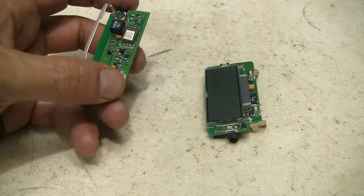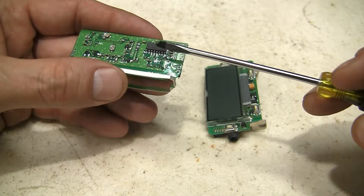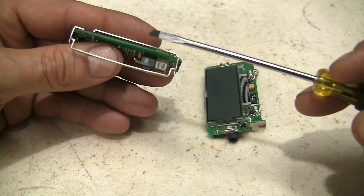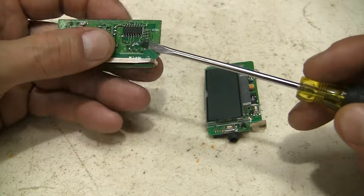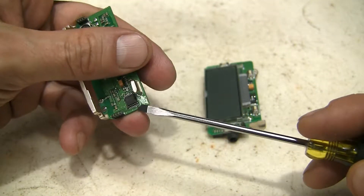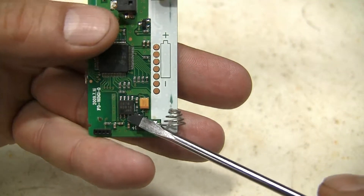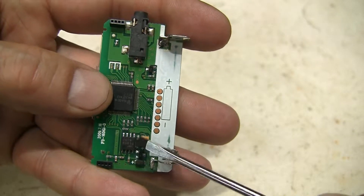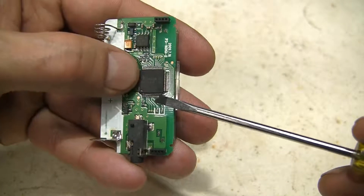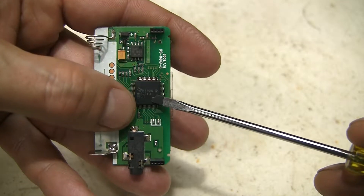Today has turned into tomorrow and I've had to pull up some data sheets and do some research on these different IC chips to determine what their pinouts are. I think this spring-looking thing is actually the antenna for the radio. This is the radio receiver chip right here. This is a signal amplifier. This chip is a two-channel MOSFET power amplifier that's going to supply the audio coming out of your headphone jack.